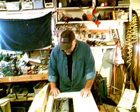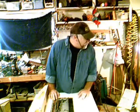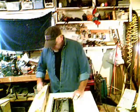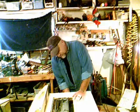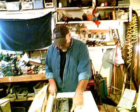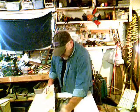There we go — we've got our saw mounted and our blade square. Now what I'm going to do is cut a couple of half-inch pieces. If the stock I grab is too wide I'm going to rip it down so it's a half-inch thick. Those half-inch pieces are going to act as spacers between the bottom of the plexiglass and the bottom of the table. I'll position one lock up here and one down here, and I'm going to bring my fence over.